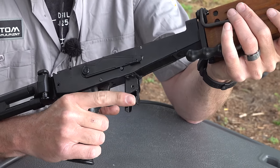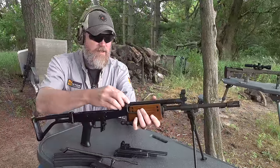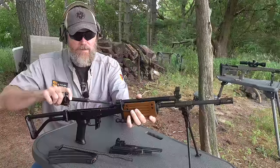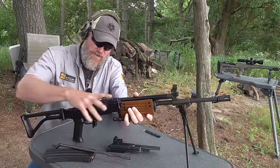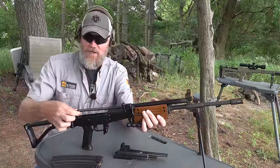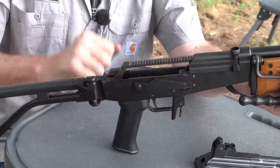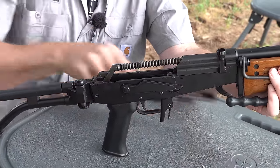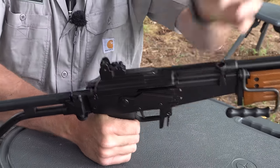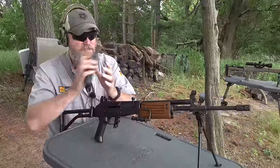This magazine bump-out on the right makes it easy for a right-handed shooter to knock the magazine out. Reassembly is a little easier than an AK because you don't have to use your bolt carrier to turn a lever up to get the gas tube off. Here's a trick I mentioned before — when I was in Israel I showed it to an IDF soldier and they didn't know you could do it: take the recoil spring guide rod, balance it forward on the receiver, put your top cover on, set it down into its slots, then simply pull the charging handle to the rear and that pops the long tail out, making it much easier to reassemble the gun.